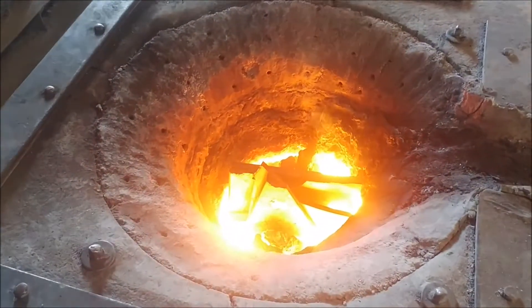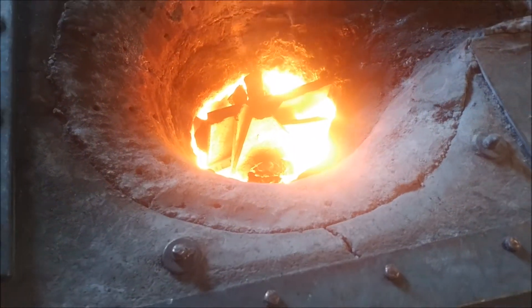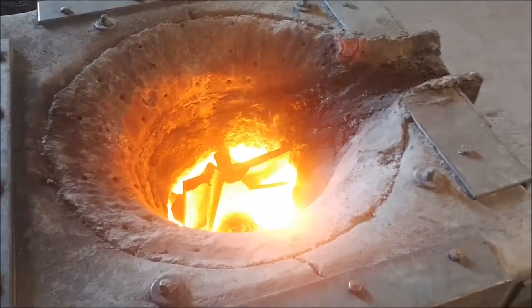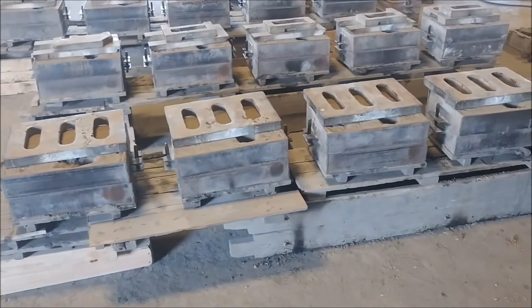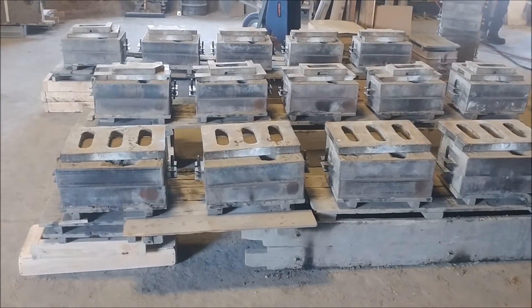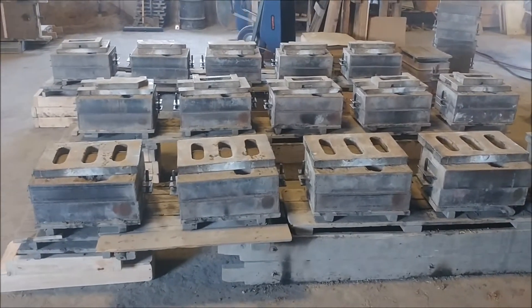Here's the last of our scrap steel and ferrochrome going into the pot. We have about 500 pounds here, and once that gets all molten and ready to pour, we pour it into the ladle. Then we come over to our boxes here and pour it into the boxes. We can do about 15 boxes at a time, with 3 hammers to a box, so we get about 45 hammers per pour.